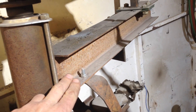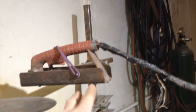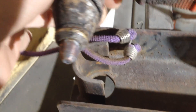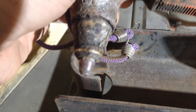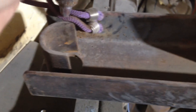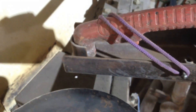The basic construction is I put two channel irons back to back to make kind of an I-beam, with this movable pedestal on it that holds my plasma cutter up here. It's simply held in place by a little bungee cord. There's a hole drilled in that which fits around the nozzle of the plasma cutter, and a used sheet piece that cups the nozzle — cups the whole entire torch — and a little notched piece back here that holds the handle. Then the bungee cord simply gets pulled over and locked on.